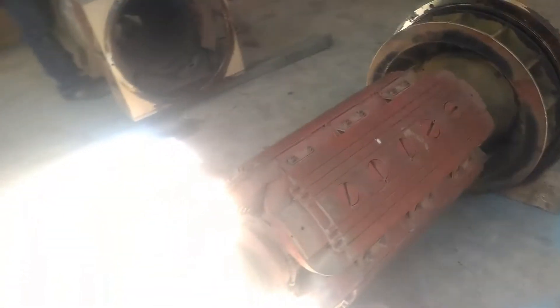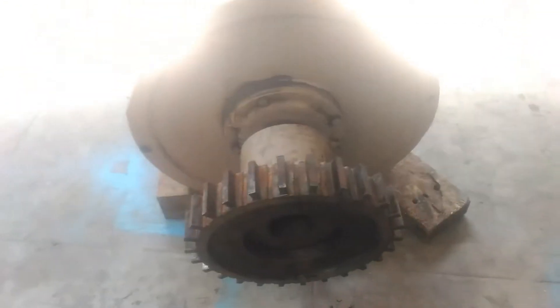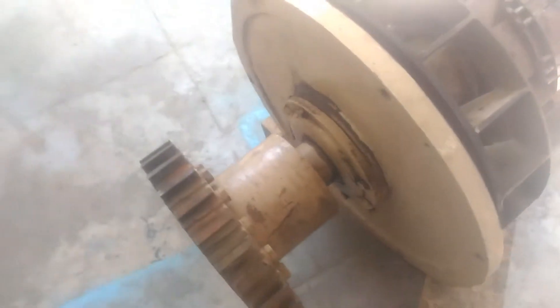And there's the massive rotor — you can see here, four bricks. The rotor seems to be fine; no problems with the rotor so far. The bearing is apart — we have a faulty bearing that needs to be replaced. And then we have a giant coupling that needs to be removed.